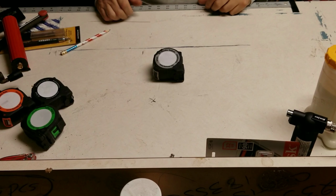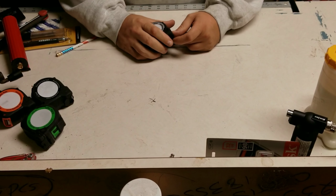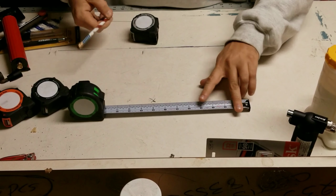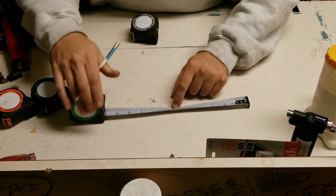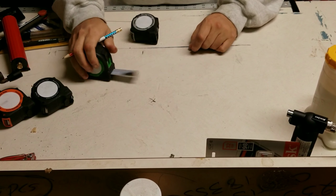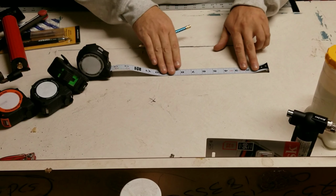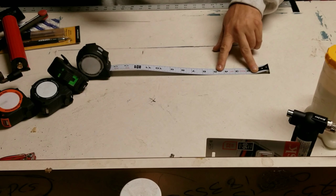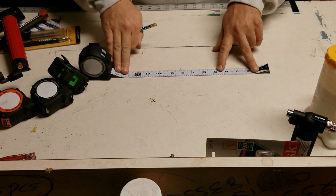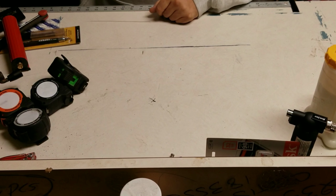Doing layout. So when I'm doing layout, here, this is a good example. See that tape measure, how it sits? And then you're trying to make a mark. Oh, you need it at 7. So now you're rolling your tape measure over, and you could be out a little bit, right? Well, this tape measure lays flat. So if you need to make a mark, you can just make your mark right where you want to be every single time. So that's called the flat back.